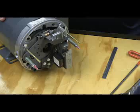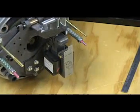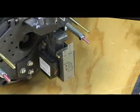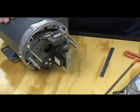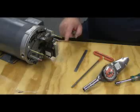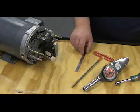If the contact point of the plunger or bottom of the T is at or above the reset line, or below the set line, the brake will need to be adjusted. The 56,000 series brake is considered a universal mount brake, meaning it can be mounted to a motor in any combination of horizontal or vertical in a floor, ceiling, or wall motor mount position. In horizontal floor mount applications such as this example, with the plunger in the 12 o'clock position, gravity will position the plunger in the true air gap position to allow for a visual check.